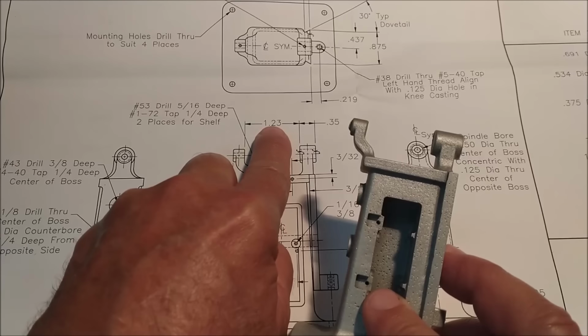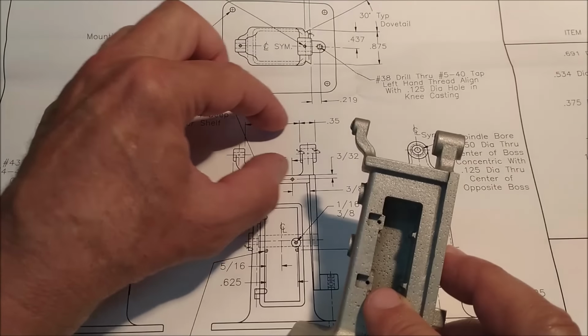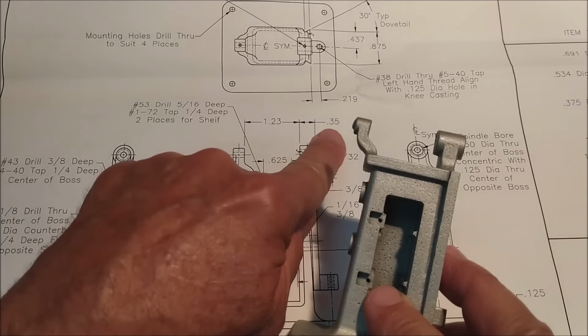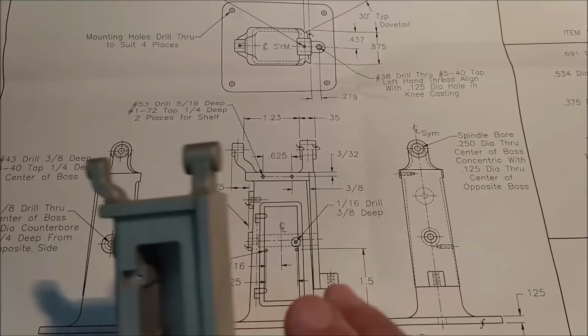I'm going to make this a little bit bigger because I'm going to put nylon washers on either side of the pulley on top so there's no end abrasion, aluminum on aluminum up there. So that'll come out to be 20 per side, so 270. And that'll reduce this down to 330 because there'll be a little bit more taken off of this side. So that 350 is going to stay where it is.